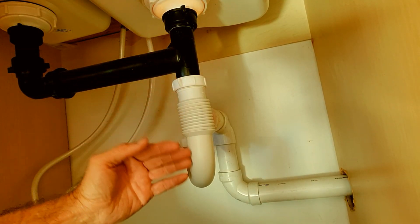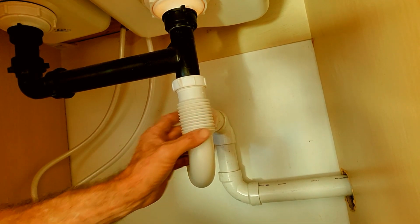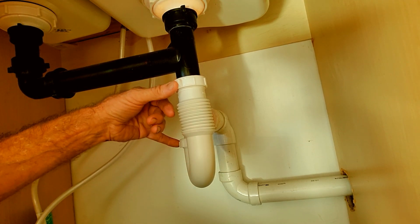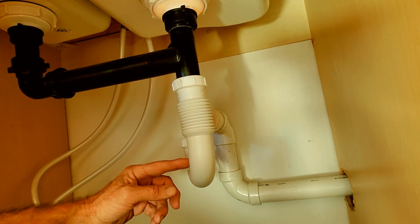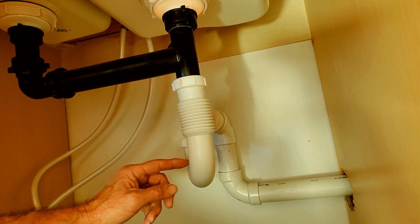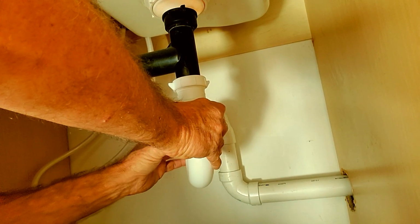Okay, here's an American Standard J-trap. Yeah, this one's got a little bit of a spongy thing on it to give it some movement, but still the same. It has a J-trap. And there's two lock nuts that hold that in place. Maybe something dropped down in here, or perhaps it's just so full of grease and grime and silt and all that the plunger cannot push or suck this out of this section right here. So you have to take it apart. Remember that this thing has water in it.